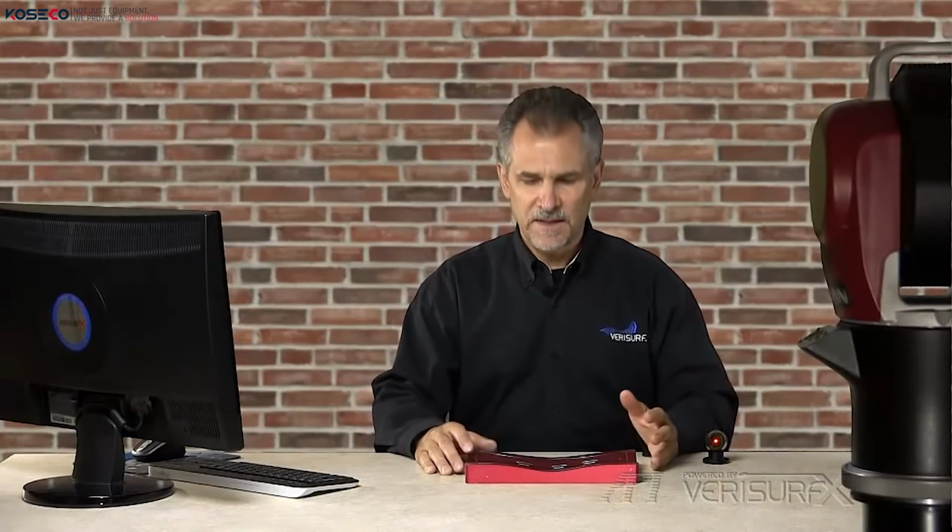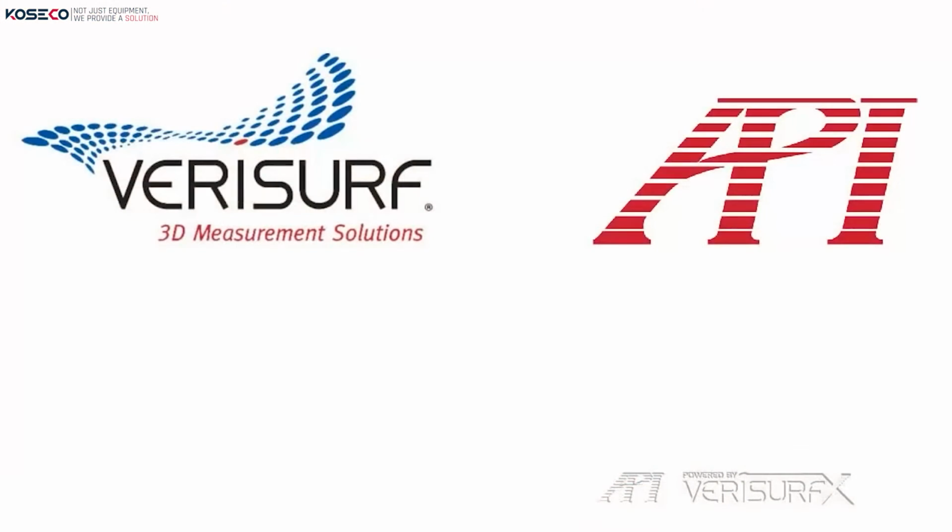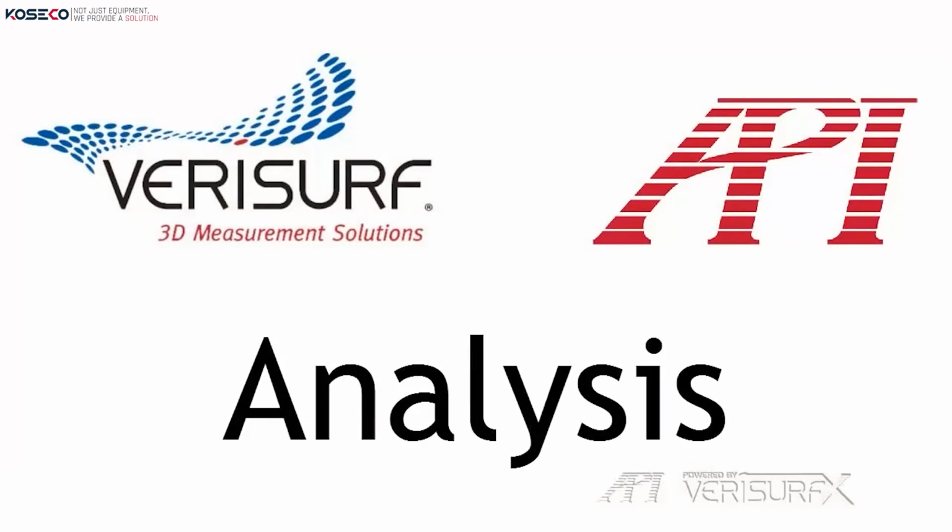This is a very simple example of a build application. Positioning a part in 3 dimensions is much more complicated, but the process is essentially the same. We've now positioned the part within tolerance. I'll tweak it a little bit for our next step. We've used Inspect mode to check our part in real time. In the next step, we'll perform a similar analysis, but we'll start by measuring point clouds.